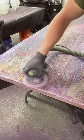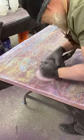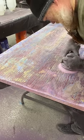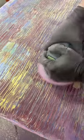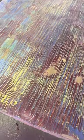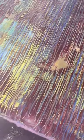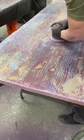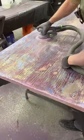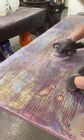Oh, that's getting really pretty there, guys. A few sanding swirls right here. I don't know if you guys see the reflection, but usually that's where you catch those sanding swirls, in that reflection, and you see those scraping striations across here from just a little too coarse of paper. And it's not an issue, I just kind of rushed that first pass. I like to prove to you guys that I'm not always perfect.